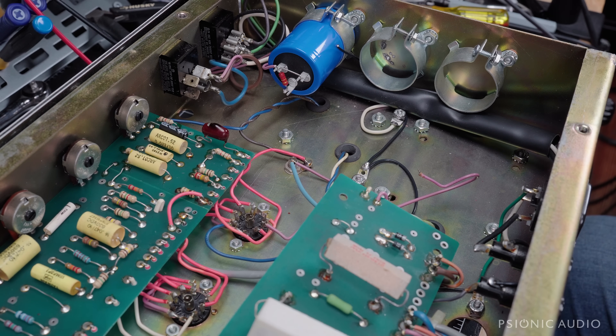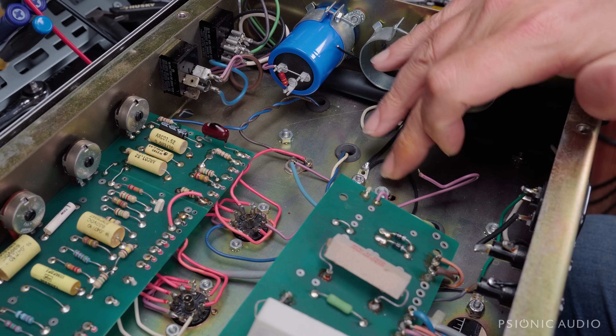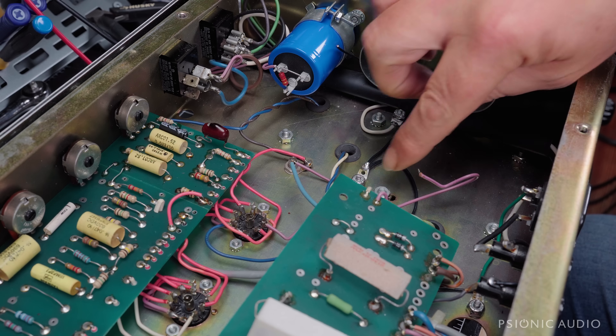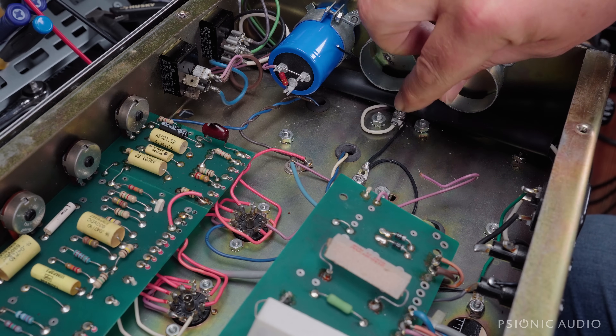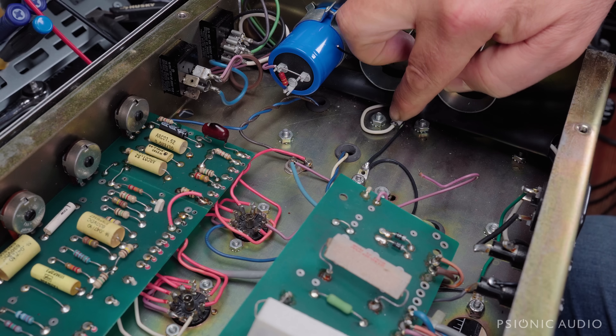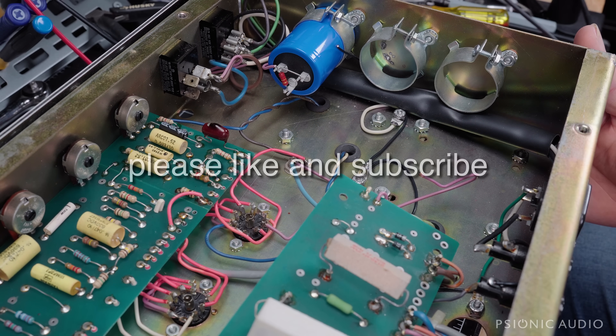I've got some new grounding locations. There are already two holes in the chassis here and here — they just have them in case they use a larger transformer, because for the 100-watt model. So I put some new ground mounting points here, some stainless steel hardware through these existing holes. This one with the white wire appears to be the shield for the power transformer.